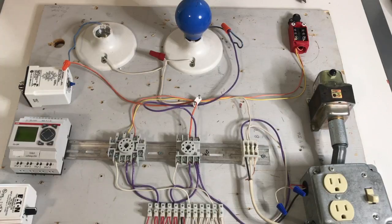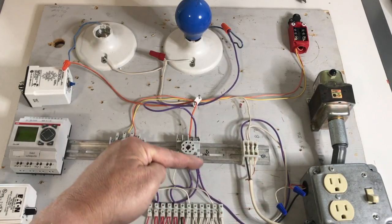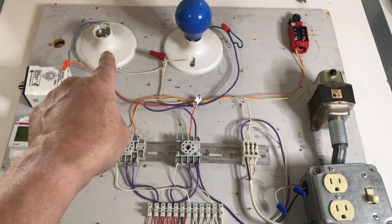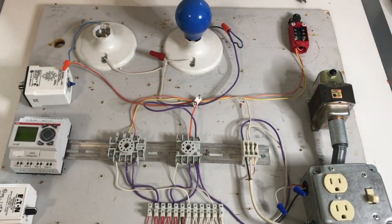Let me point out what I've got going on here. Over here I have 120 volts going to this bus, so that's a constant hot 120 volts. There's neutral. I also have a switch leg coming out of here, which I'm taking to pin 2 on each of these two different types of relay bases, which we'll get into later. From here I have this lamp that's going to stand for my load every time it's switched. Sometimes I use the normally closed and normally open to show the difference, but today we're just going to be focused on this load here.